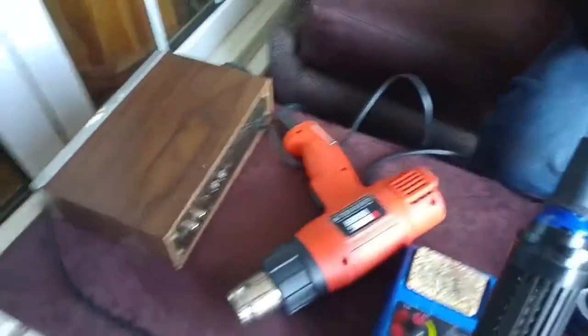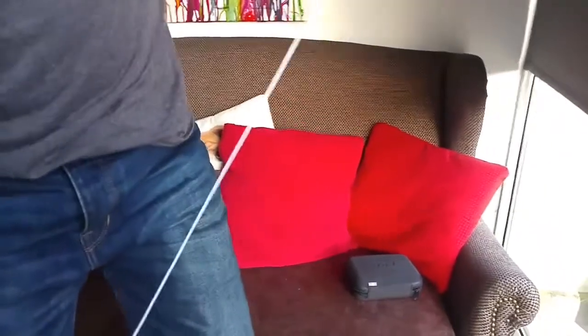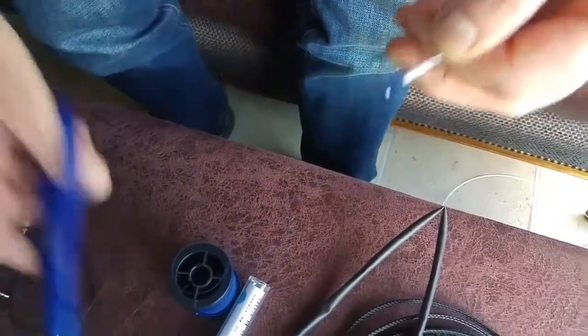We've made two conductors earlier and covered them over the silk with PTFE tape. Now we need our third conductor, so we're just going to measure the same length. These conductors are made one meter 300 long because that's the length for the cable we want — it's slightly shorter but takes into consideration the twist. We'll take it up to there and cut that off. Now we have our three conductors and we need to cover the third one in PTFE tape.